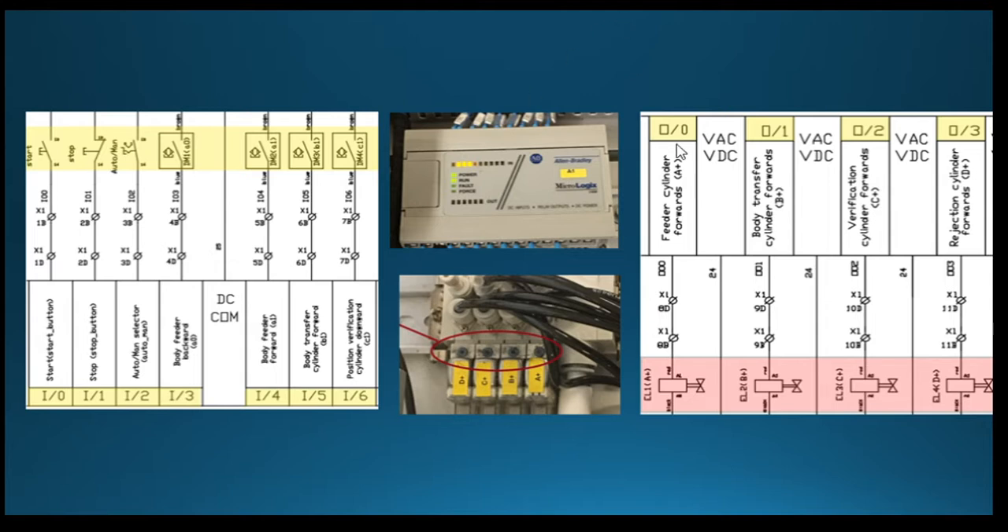On the output side, there are 0 through 5, so 6 potential outputs, but we'll only be using 4 outputs. And what we'll see is if one of these outputs is actuated, one of the indicator lights will come on. What you'll see is that we have three indicator lights here. That shows me that the stop button is being pushed.